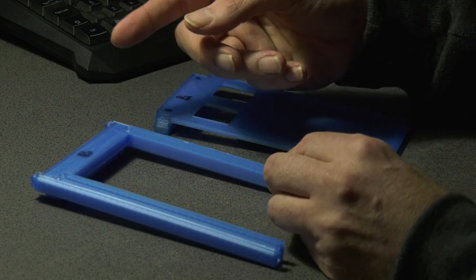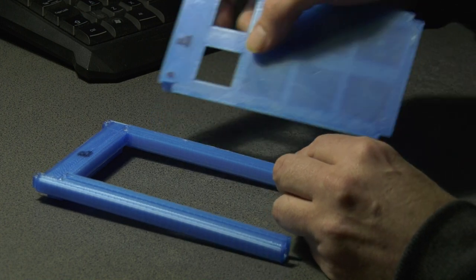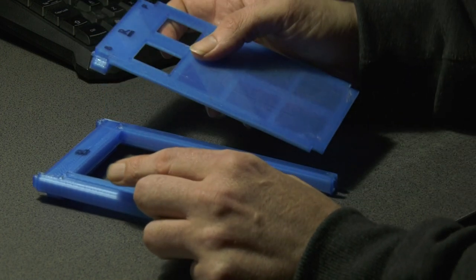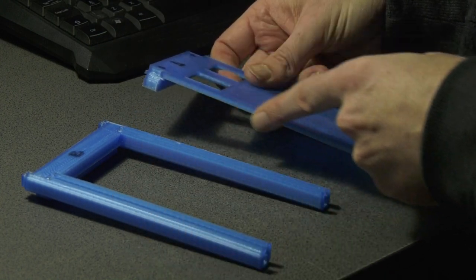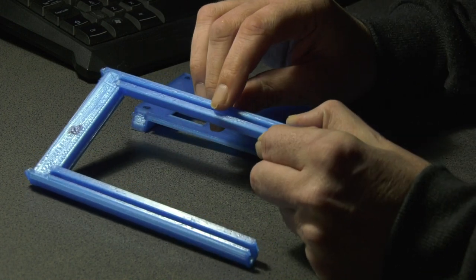Now, recall what I said about the 2 meter wide car trying to fit down a 2 meter wide tunnel. It's just not going to happen because both parts are vying to occupy the same physical space. So one of two things has got to happen. We either make this wall piece here thinner, or we make this slot wider.